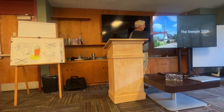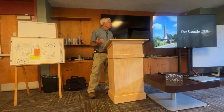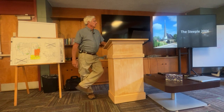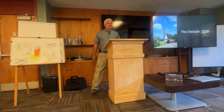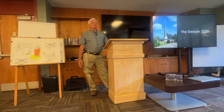I called the steeple people the next morning and they were fantastic to work with. It came in on two semis — two sections on trailers on a giant hinge. We had a 130-ton crane and a 100-foot snorkel lift. I poured 19 cubic yards of concrete in the base with about 16 sets of anchor bolts.